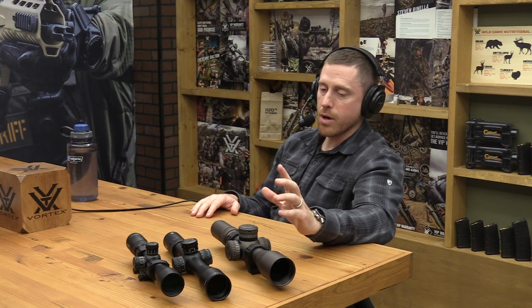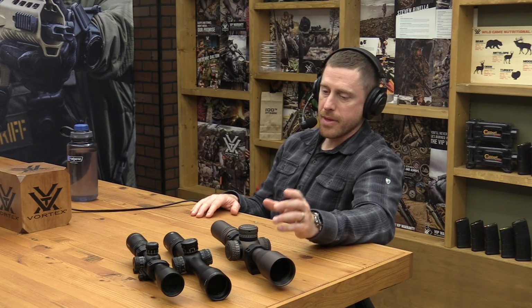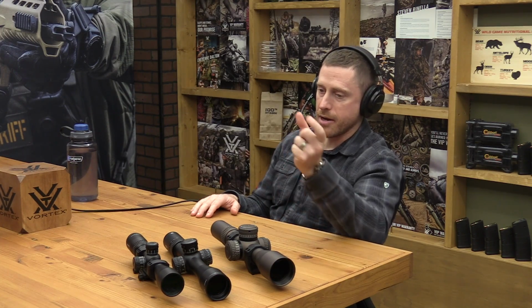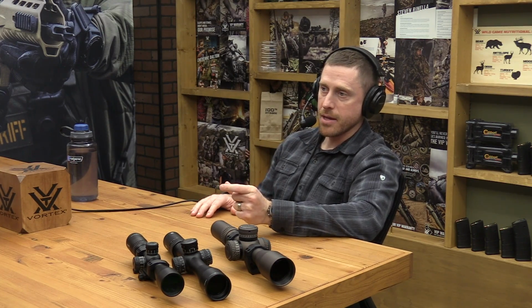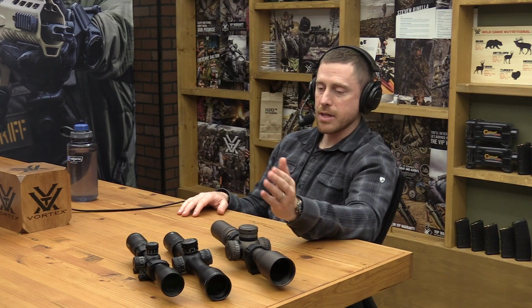Then you've got your erector unit, and you might have five or six or seven lenses just in the erector unit. There are probably at least four on a typical system that are moving when you're dialing your magnification. And when I say four, that would be two doublets: two lenses cemented together that are moving in tandem, and then another set of two lenses cemented together that are moving in tandem. It would look like just two lenses moving together, but they're technically two cemented together in each part of that erector tube. And then you've got an eyepiece, which could be three or four lenses, and there might be a couple of other lenses in front of that eyepiece too.